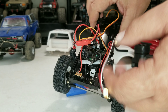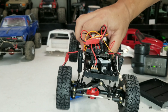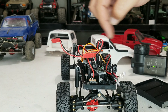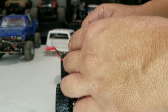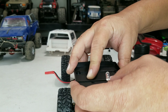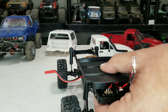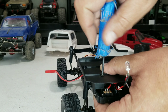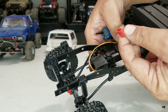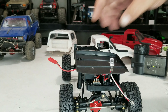I'm going to pull this body off and transfer it over. The lights are installed — positive on the end, negative on the inside of the board. Then it's time to button everything up. Get all the assembly underneath — just make sure to tuck all the wires nicely. There are two holes that line up using the same screws you've been using throughout the whole kit. Don't forget when doing this that the LED lights should be pointing out the front, and your battery lead should be coming out the back.